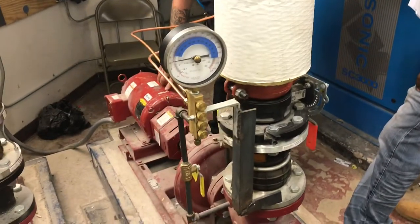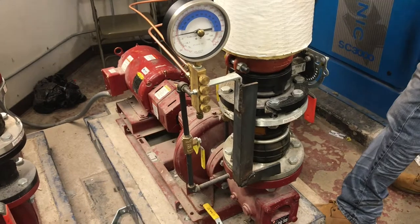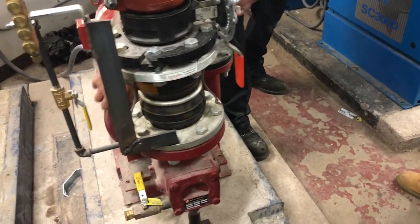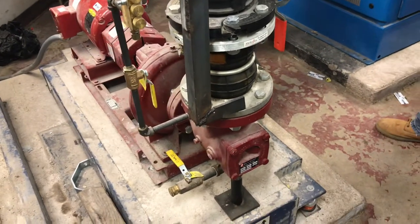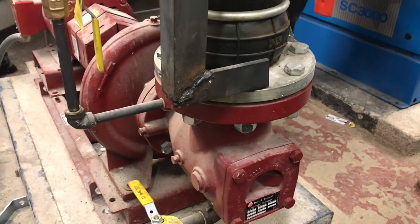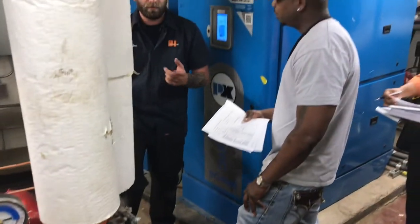There are directional arrows. There are some on the motor. You'll also see, I believe, on the pump end, there's another arrow here. That's also a directional arrow, so you know which way it's supposed to be. Those are the three-phase motor, yes. Which is a reverse rotation. This can be reversed, so if you swap two leads.